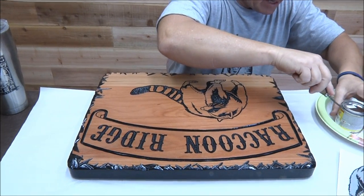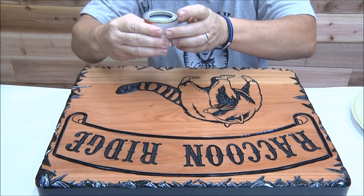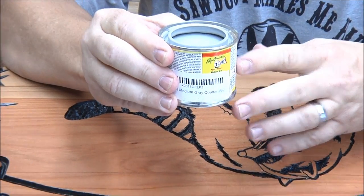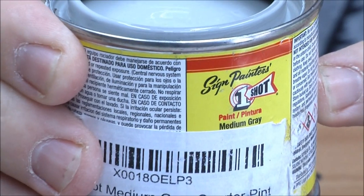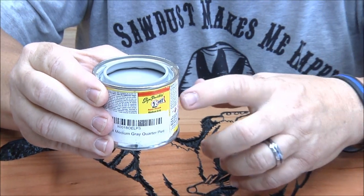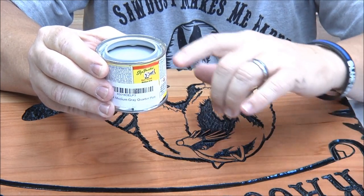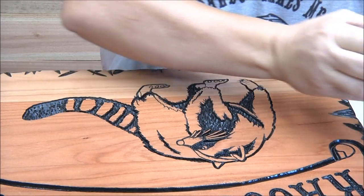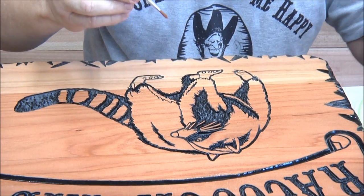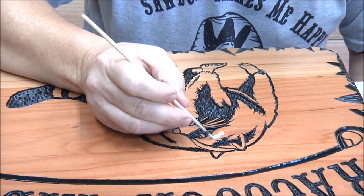What I'm going to do here is paint the surface, but I'm going to use a paint I've never used before — somebody turned me on to this. It's called One Shot. This stuff is made for automotive use, for pinstriping and lettering on motorcycles and other things on metal, but it works really great for wood. I tried it for the first time last night on another collaboration you guys will see down the road. It's oil-based, so you clean up with paint thinner, and this stuff just goes on so nicely.